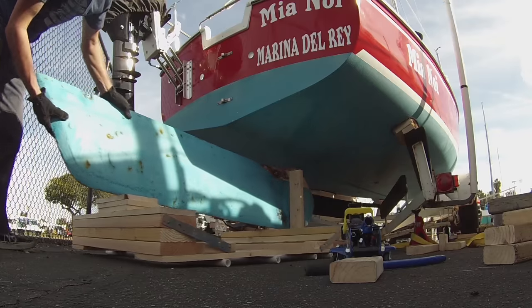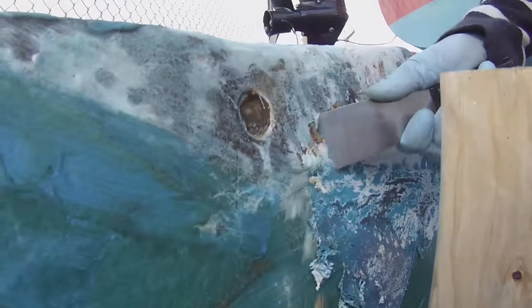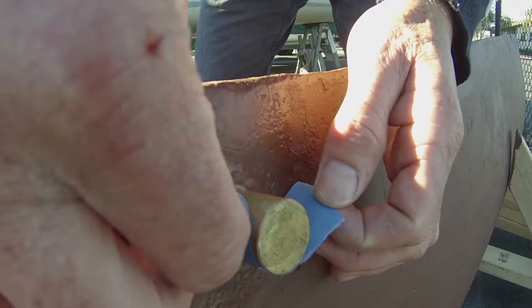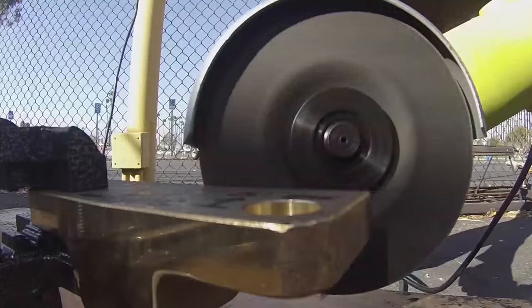Taken about a month. I have dropped the keel, removed the keel, cut out the weldment, re-fiberglassed the weldment back in, repainted the keel trunk, scraped back the keel, replaced the keel bolt, epoxied the keel bolt back in, applied an epoxy barrier over the keel, painted the keel, and ground back the hangers so the keel should fit snugly in the trunk. Moment of truth, I'm going to put the keel back in and hopefully be back on the water tomorrow.